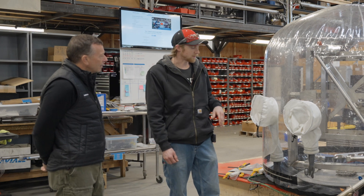In our production gear, a couple other things. There is a new aluminum step — we did some testing on this, were able to pull out some more material on the aluminum step and add a couple little design touches. All titanium gear comes with step mounts welded on the titanium to put the step on there. We're not including a fuel step option for the other side at this point. And of course, all welding on this gear has to happen inside the bubble, so it has to come from the factory with all the weldments done on it. We also opted through testing to stick to an inch-and-a-half axle on the gear — that was to simplify supply chain, production, jig making, and FAA approval. The majority of the gear we're selling now uses that size.